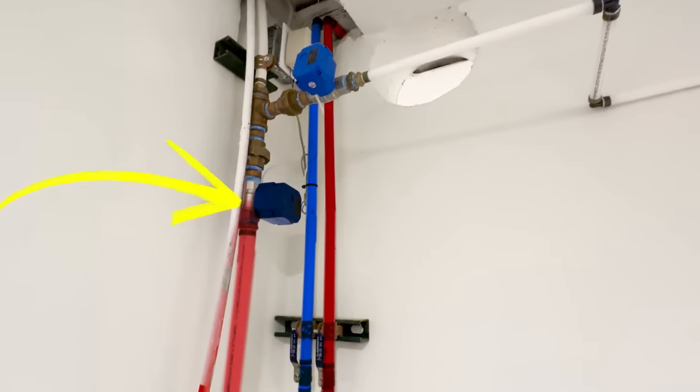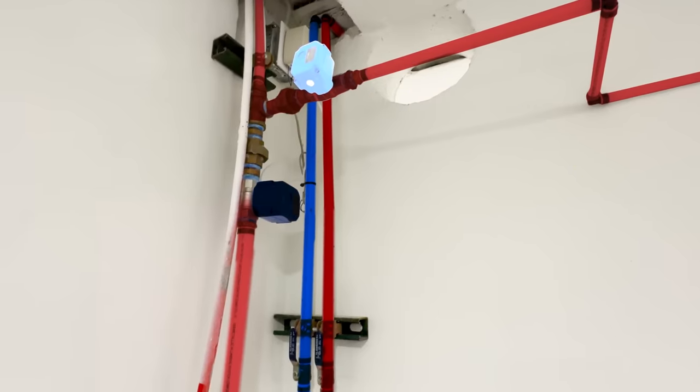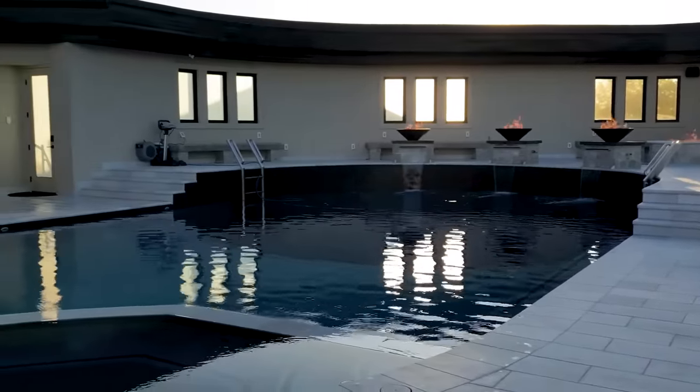When the shower's done, the timer goes off on the electronic control, no outside valves, and simply the one valve that's currently letting this water go will close. Simultaneously, another one opens that is the direct connect of this water feed and opens it straight down into the drain. As soon as this turns off, you can see the steam coming off it right now, this water is draining right there to the floor. As soon as this turns off, instantly, this entire water line empties 100%. The little loop at the top, half of it drains out the shower head, the other half all the way to the basement. So 100% of our pool, barbecue, faucets, fixtures, shower, and hot tub auto-winterizes 24/7.